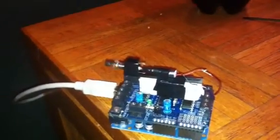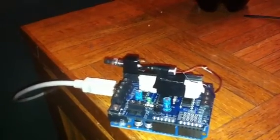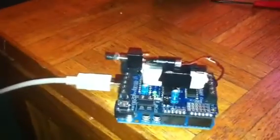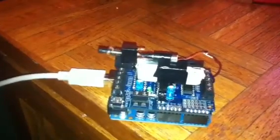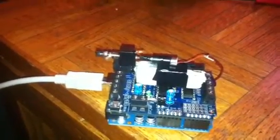The idea is that slip rings around this size are prohibitively expensive, at about $1,000 or so. So with further development, you should be able to get this one to work, but right now it's struggling. I've got it at about half duty cycle — anything less and it'll stall out. So the concept's there, but it needs some work.